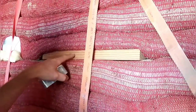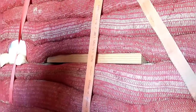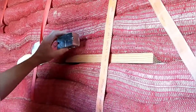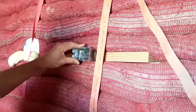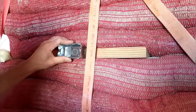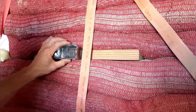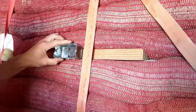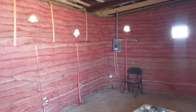Here's one of the boards that Kyle inserted. Most of them are a little higher on the wall since we just didn't think about doing it until the walls were already built up. But here's an example of how you could attach your electrical box directly to that. If you're really thinking ahead, you could attach the box to the two-by-four, insert it into the wall, and when you ran your next course it would pretty much cover the box with just a little bit sticking out. So you could recess it to whatever depth you liked. We're also attaching an outlet box to a board attached to the window frame — another creative way of providing a base for outlet boxes.